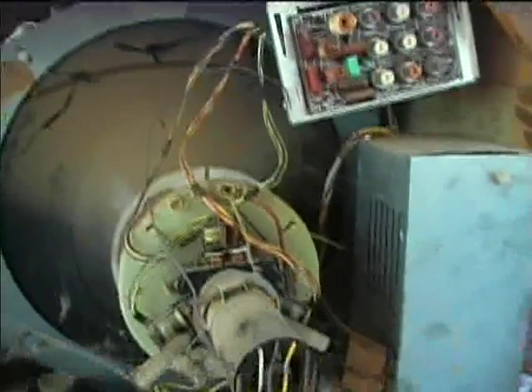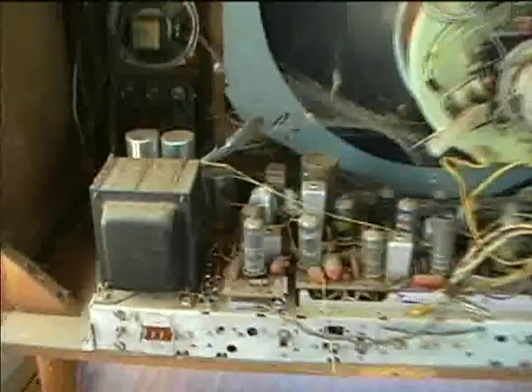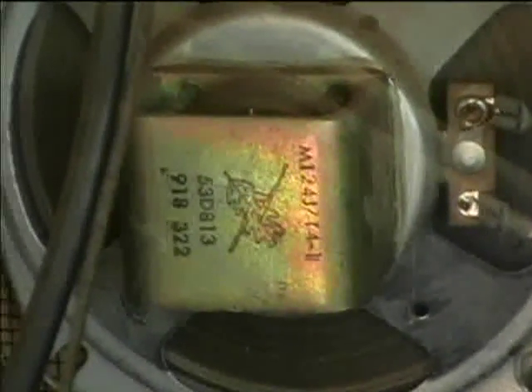The tube is going to need a lot of work to repair the PVA delamination. These are actually General Electric electrolytic capacitors on here. This is an RCA CTC15 design, but it was made by GE. A long time ago I put a cathode fuse in there on the horizontal output tube. The speaker is made by Sylvania — you can see that leaf logo with the S, which designates Sylvania.